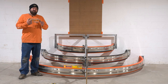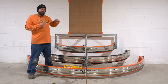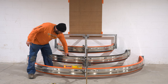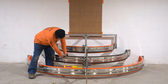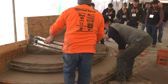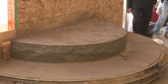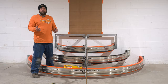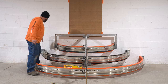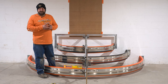We've shaped these liners so they go over top of a piece of steel, which does one great thing for us — it allows us to not have to use any screws. You don't have to screw your liners in or attach them in any way; it just has a lip that slides over top of that steel. These are made to a standard size, and the rubber will expand and contract a little bit depending on temperature. If it's around 80 degrees it'll fit tight; if it's a little colder there might be a small gap. Just pull it together in the center so the centers are butted up, and any small gap on the edge you can detail, fix up, or knock off with a chisel later.